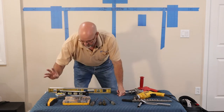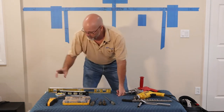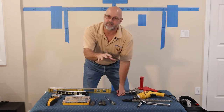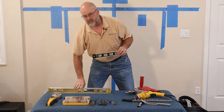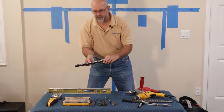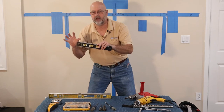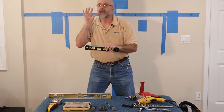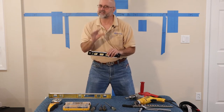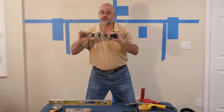Don't use your blankets from your bed. Don't use a tablecloth. You want something with padding in there that's going to cushion it, because we're gonna put the television face down on this. And then with the tools, we're still gonna use our stud finder. We've got our studs mapped out here, but we don't know exactly where they're going to be when we put the bracket up there. You're gonna need your tape measure, because you're gonna wanna make sure that you've got everything in place. You're gonna want your drill bits. You're gonna want your screwdrivers for mounting the brackets to the back of the TV. You're gonna want levels. I use this one here — I've got a bigger one in my truck, and I also use this small one a lot. This one is cool because it's got a magnet on the bottom, and it's small enough to where I can use it one-handed while I'm moving things around to make sure that everything is level on the wall.